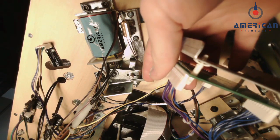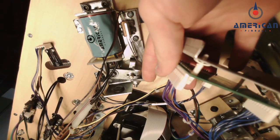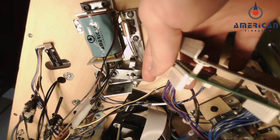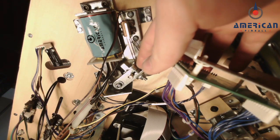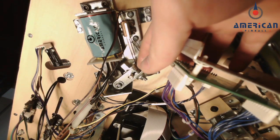Well, early Houdinis didn't have an end of stroke switch. This was controlled by the code. And so what would happen if you had a speeding ball that would come and hit your flipper bat while it's in the held up position, it would hit the bat and then your flipper would die, because there's nothing telling the coil that you're holding that switch in.